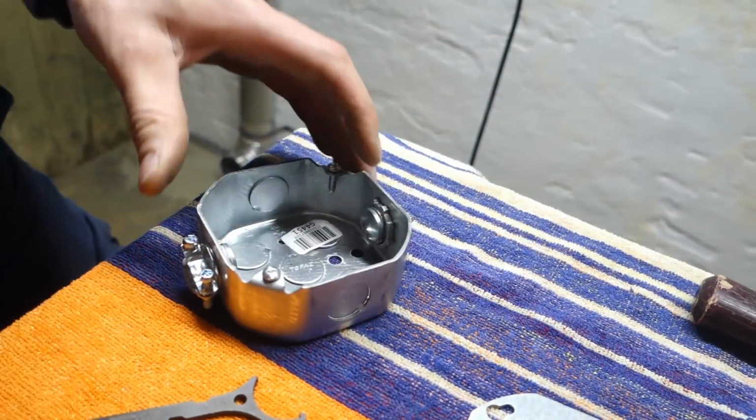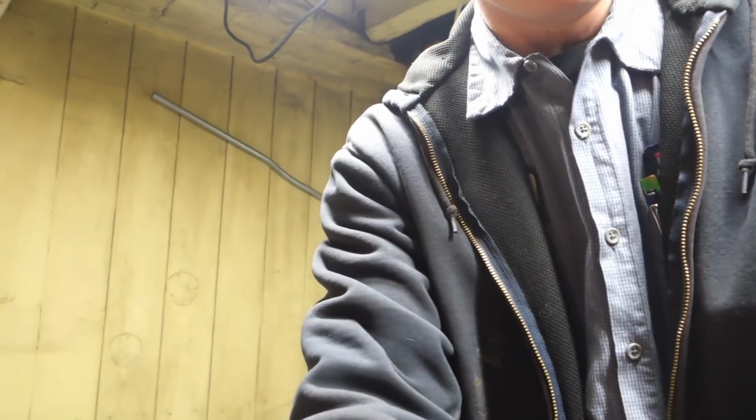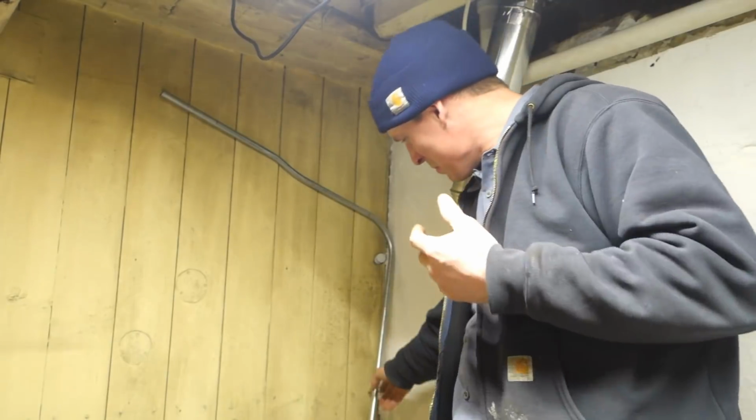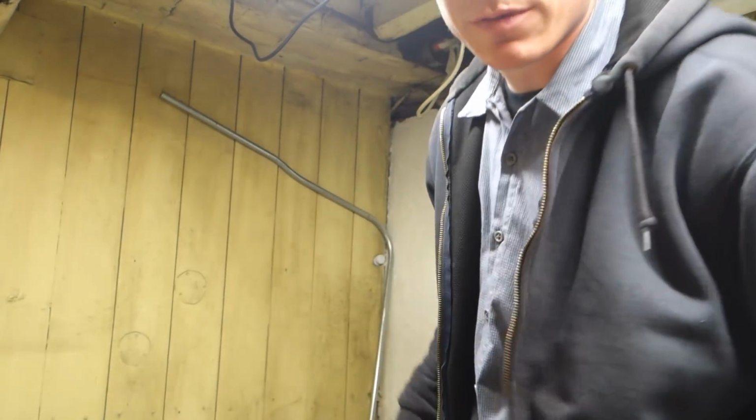With what I got. Not that I'm saying I'm better than a handyman or the neighbor friend down the road. It's just, I can guarantee you they're not going to get an electrician for this. So really we're required to run some protection around the wire going down a wall, like in this case in the basement. And I had to get some stuff anyways for this, so I got some 1/2-inch EMT for my 10-2, and we're allowed to do that.